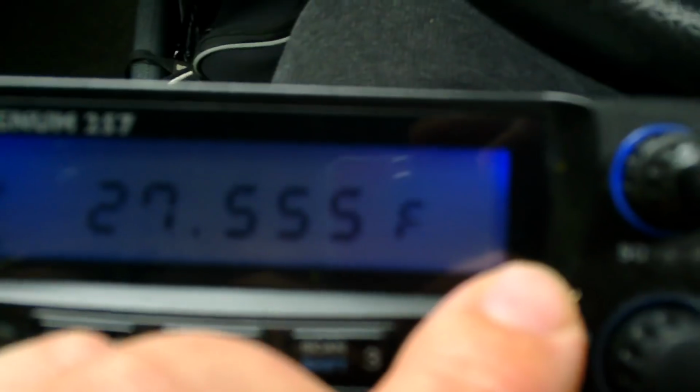Now the only downside of that is with the Albrecht 485 you can set it on frequency on sidebands and know that you are on frequency. With this one there's no notch, so you've got to basically listen to the band, keep it at 12 o'clock obviously, but you never really know where the true 12 o'clock is. It could just be a cat's whisker either side. So you listen to the band and basically tune into them and hope that they're on frequency, and then you'll not be too far out yourself with a bit of luck.